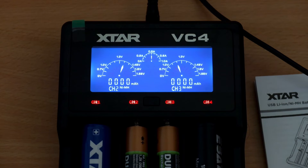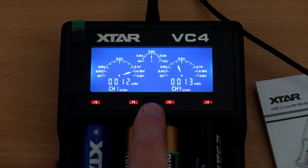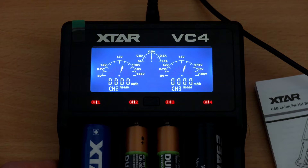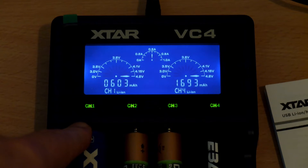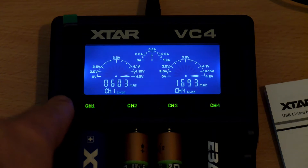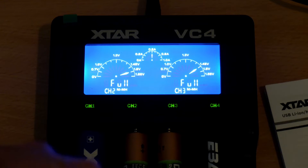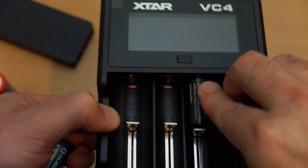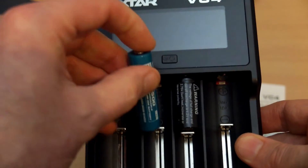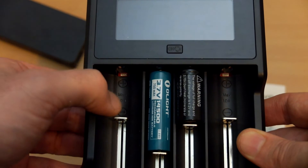There's a way around charging lithium cells at a lower rate — you could attach it to a low-power output USB adapter if you wanted to, though half an amp is usually sufficient. You can also see how much it has charged into a cell in milliamp-hours, giving you an idea of capacity, though it's best to start from fully discharged for accuracy. It's not as precise as a discharge test like on the Xtar Dragon. For smaller lithium batteries like 14500s and CR123As, I usually use the inner bays at half-amp charging.